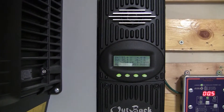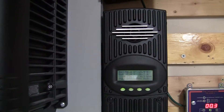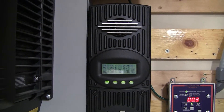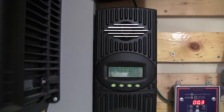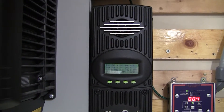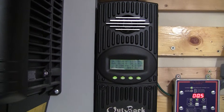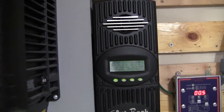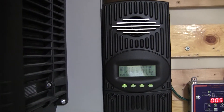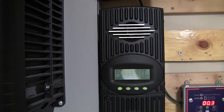I'll have to put the link in there for you — there's a webpage with a calculation you can do depending on your latitude and whatnot. Mine optimal for winter is around 51 or 52 degrees, but my tilt won't go up that high. So 42 is fine — it did pretty good last year at about 42 or so.